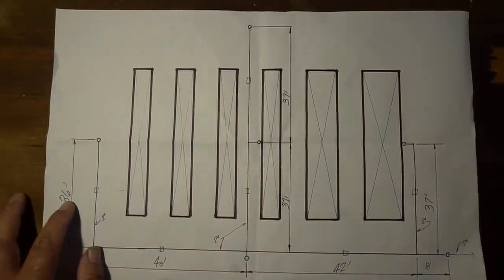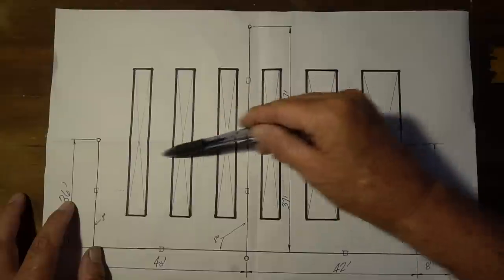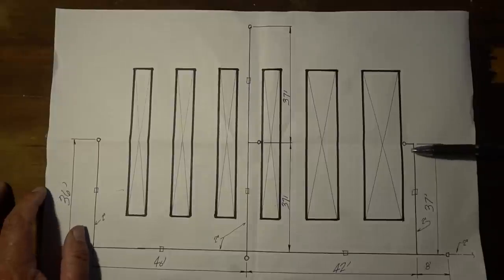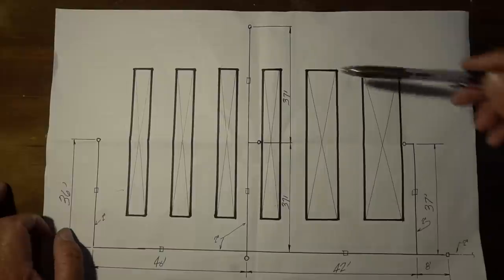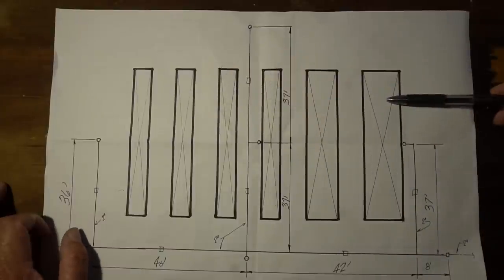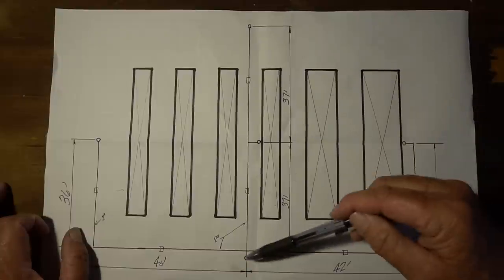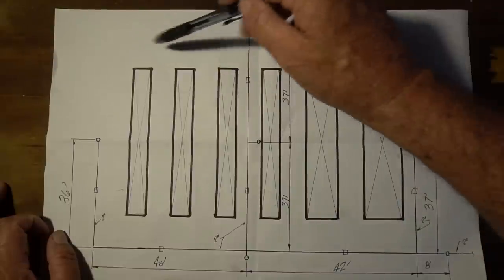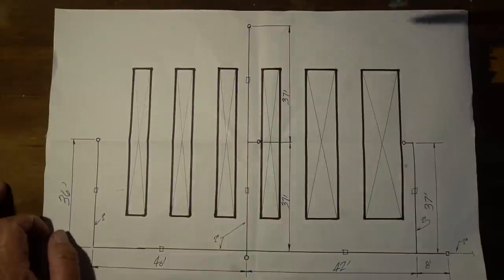And the first thing I did was I drew up the 6 beds so that I can arrange the heads to make sure that I have 100% irrigation coverage when I activate the system. These sprinkler heads throw a 15-foot radius, so once I had the layout of the beds arranged, it was real simple just to say, hey, this one will cover this much, this one will cover its 30-foot diameter, and this one will cover a 15-foot radius or a 30-foot diameter.